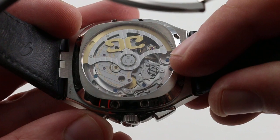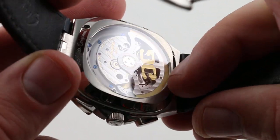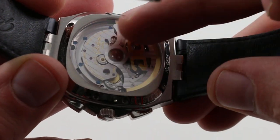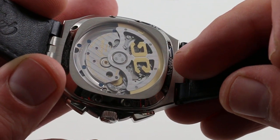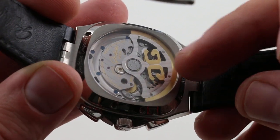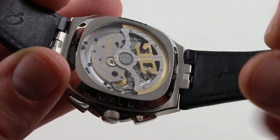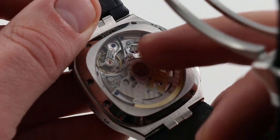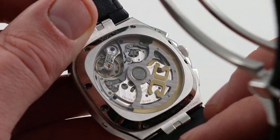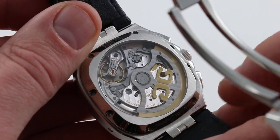Column wheel — traditional horology at its best. The three-quarter style bridge harks back to the pocket watch golden era of Saxon watchmaking in the 19th and early 20th centuries, and there is the characteristic double spiral transfer wheel for the winding system, which is a signature of Glashütte. There's also a beautiful black-polished swan's neck fine adjustment system atop a balance beating at 28,800 vibrations per hour.